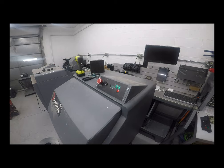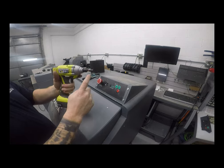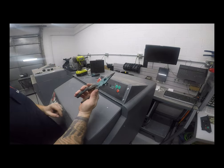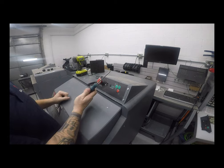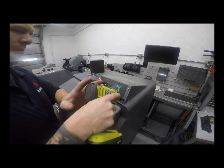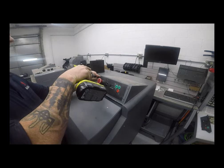For 5025 and 5315 mixers a little extra work is needed. You'll need a 5/16 socket or nut driver, a pair of needle nose pliers, and a Phillips screwdriver. First we're going to start by zipping off the 5/16 nuts that hold the timer plate onto the machine.